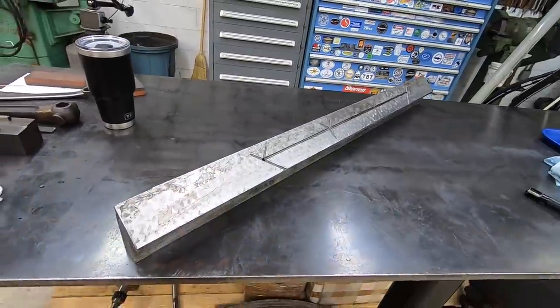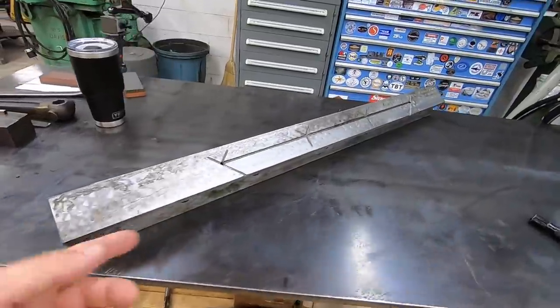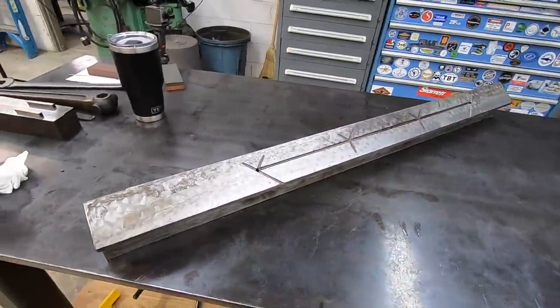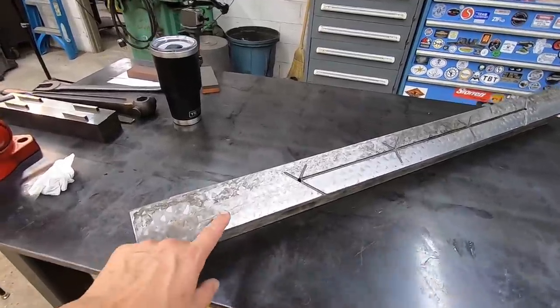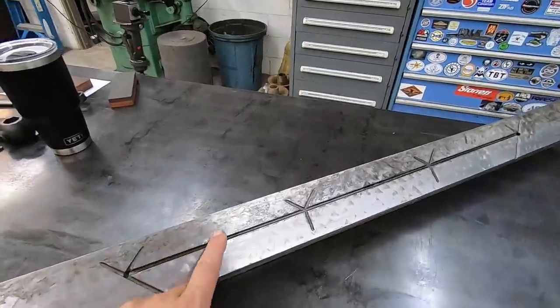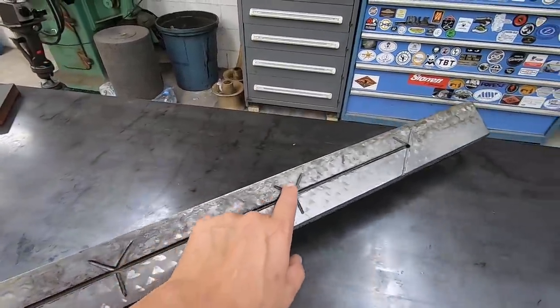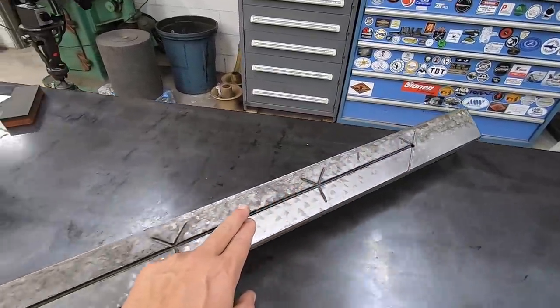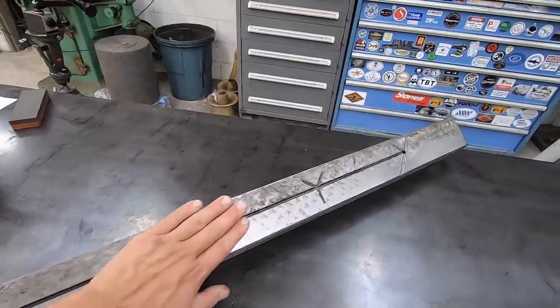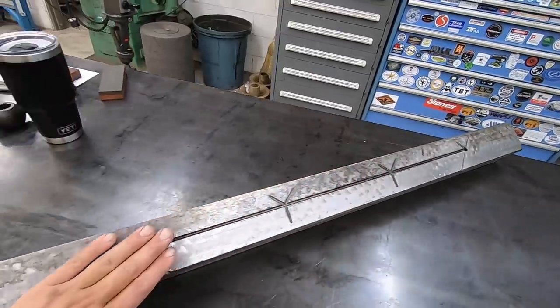I had to pull this gib right there. And that's the first time I've ever pulled it out. So this is the first that we're actually looking at it. And it looks pretty nice. You can still see all the flake marks in there that the factory did. This was from where it was sitting for a very long time up at that other machine shop. It just had a little bit of corrosion up in there between the two surfaces from not being used for many years.